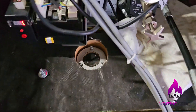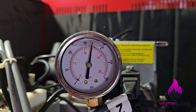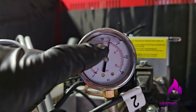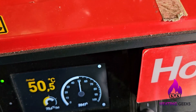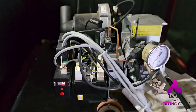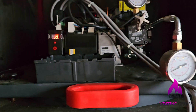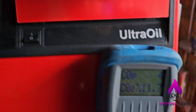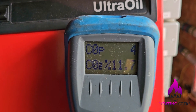That's what it was — the misaligned sight tube. The pressure is a little high. It should be around 10 bar on low and 22 bar on high. But we are running — good news. I'm just doing the combustion check now, running at max. Two dots signifies max power. I can't quite get the CO2 up to where they want it — 12.5 to 13 — but it's up and running.